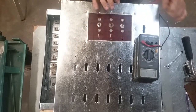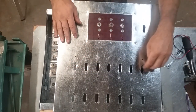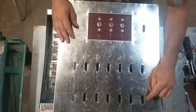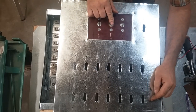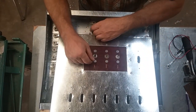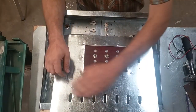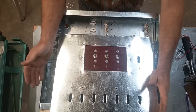The way I'm setting this up, it's going to be single phase. This will be the A leg to neutral. This will be the B leg to neutral. You know, we're going to call this one A, this one B, probably this one neutral. I hope I'm still in frame. A, B, neutral. So this way I can set a really bad, wild, unbalanced load on the generator.